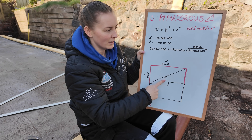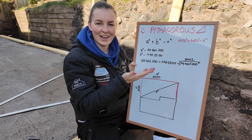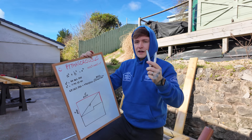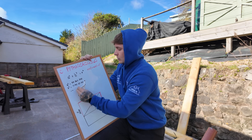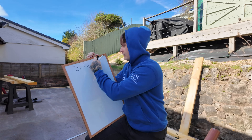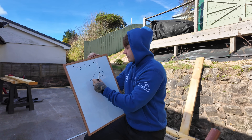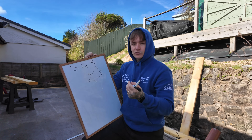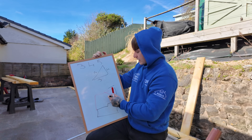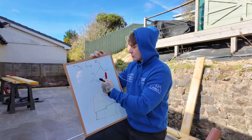The number you need is 8,942. That's the whole theory behind it that Jodie's just explained. And to make it even simpler — take these simple numbers: 3, 4 and 5. These are just magic numbers so that if you have a triangle and this side is 3, this side is 4, this side will always be 5. So an easy way — if we go back to the shape of our house — you can measure 3 feet this way, 4 feet that way, and if that diagonal is 5 feet, it will be perfectly square. I don't know why, the numbers are just magic but they are.